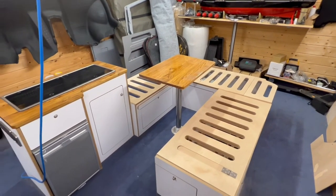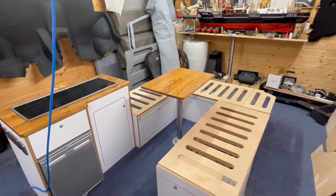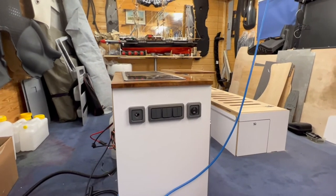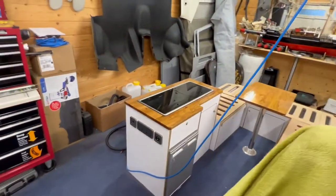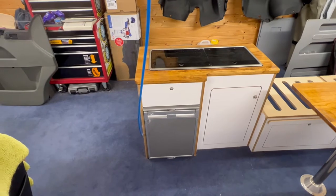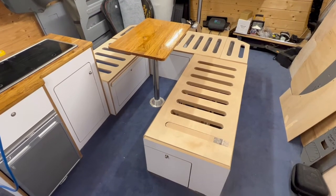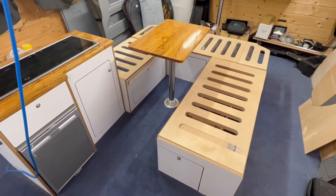It's not without its limitations, and our testing has confirmed that. One of the first practical issues identified is very limited space for switches, sockets, and various pieces to attach things. What that's meant is we've had to be very careful with the installation, but it's also allowed us to develop the electrical installation such that all of our electrics are concentrated in this single central unit, which includes the cooker, the hob, all of the plumbing, the electrics, and the fridge — 12 volt and 240 volt. All of the rest of the equipment in the back will be easily removed with no electrics to detach, which means we've actually got a very usable van for van purposes.